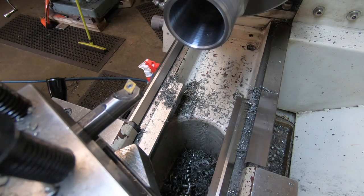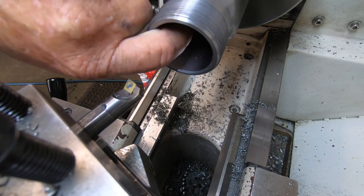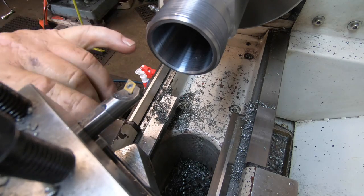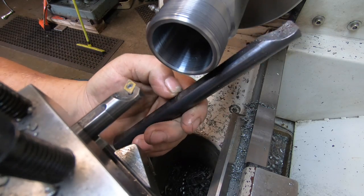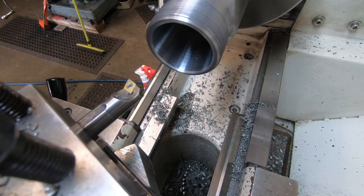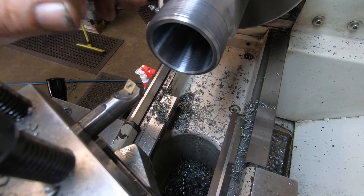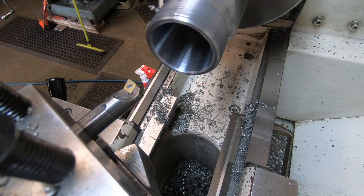That's it. I'll be honest, I am struggling with the inside bore down the body of it. It's not real good. The boring bar is not rigid enough. It's a 16mm boring bar, and it's just not rigid enough when there's a lot of stick out, obviously. A future project could be to build a decent, say a 3/4 or 1-inch boring bar, as long as it fits down a 1-inch bore, nice and rigid. Could be a future project, not too far away.